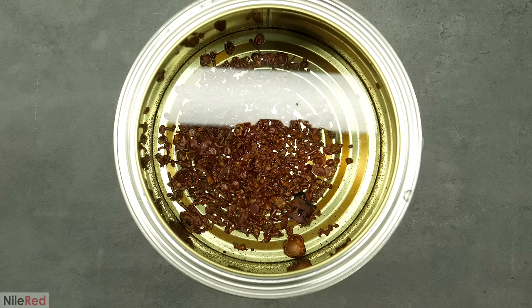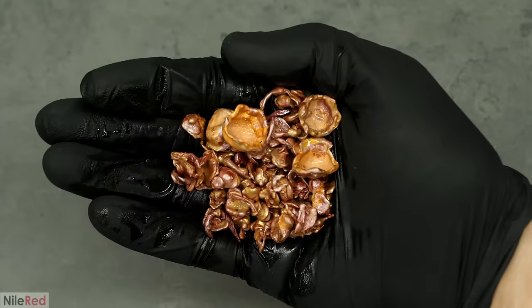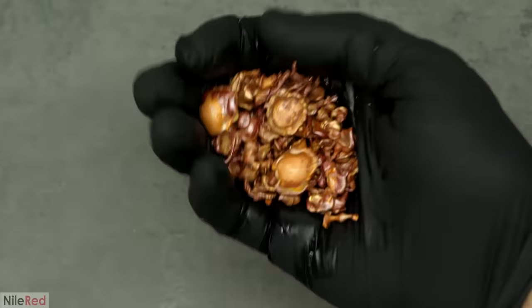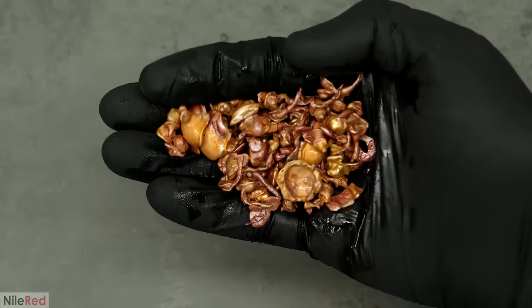But anyway, getting back now to what was thankfully not a catastrophic failure, all my gold alloy was now in this can. So I just quickly got rid of all the water, and this was what it was like. By dumping all the liquid metal directly into water, it created these pieces that have relatively high surface area. Ideally though, they would have been a bit flatter and looked more like cornflakes, but I think I just didn't pour it from high enough.